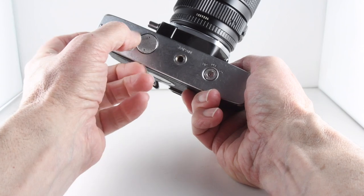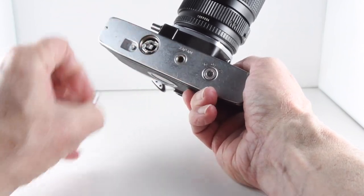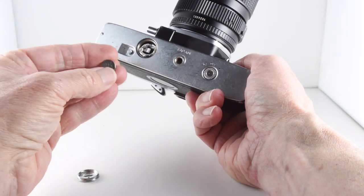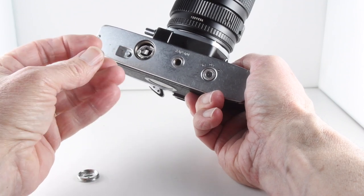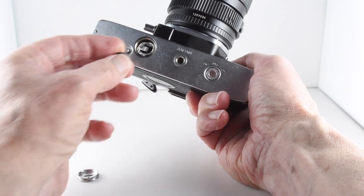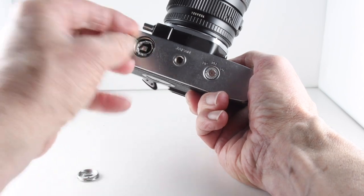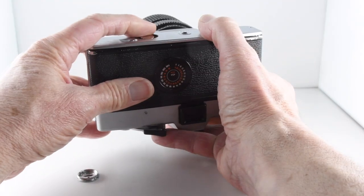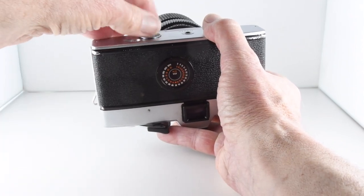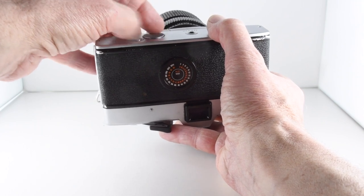The meter requires a battery. The battery is fitted on the base here — it requires a PX625 battery, which I don't have. I do have a slightly underpowered LR44 battery, and I've just put a piece of foil there to help pack it out, otherwise it rattles around. By putting the positive uppermost, it just enables it to stay in place, and then I can put the battery door in place — there we go.